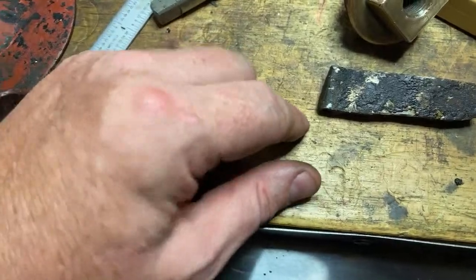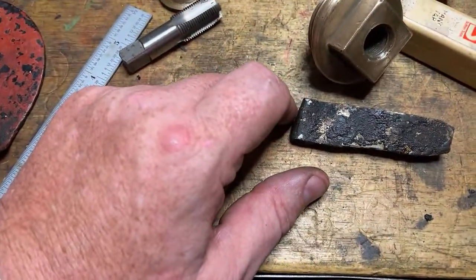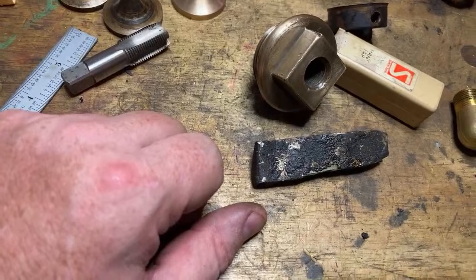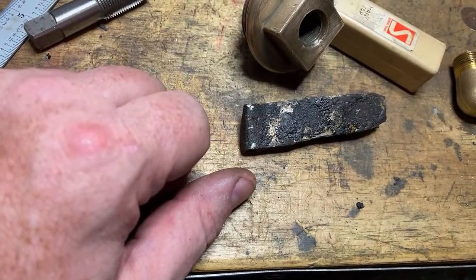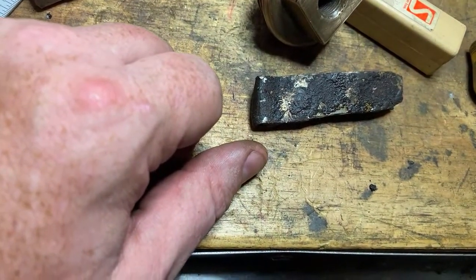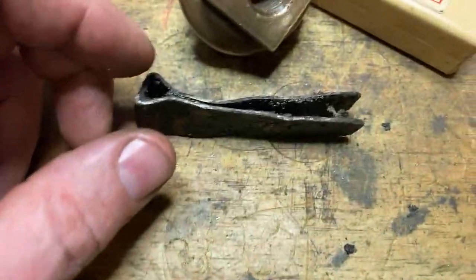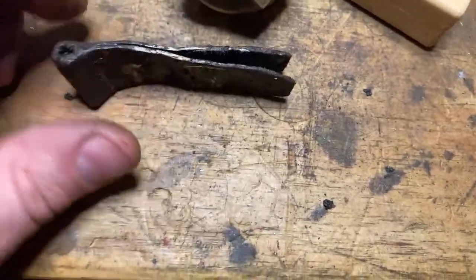You put a ring on it and a bit of wire rope, and attach them somewhere to the boiler. Then when you pull them out, they just hang down and you don't actually lose any of them, which would be really nice because usually when you pull them out, you're sitting in 2 inches of water and on top of about 2 inches of soft grey ash and quite a lot of clinker about this size. So finding the 6 of them is a bit of a job once you pull the ash pan off. And if you've got to drop the ash pan in a hurry, this isn't a fun thing.